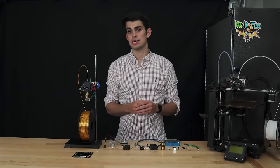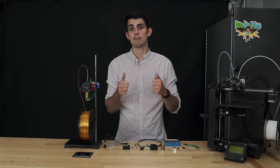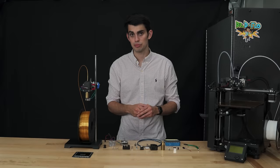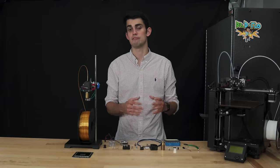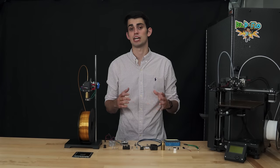For people new to 3D printing, the extruder not only has to eject filament on demand, but it also has to retract filament in order to move to unconnected features or parts on the build platform. This hysteresis or lag in the extrusion process is amplified when printing flexible filaments, so it's best to avoid the Bowden setup when you expect to print flexible parts.